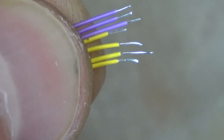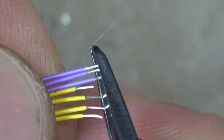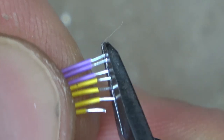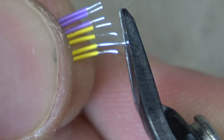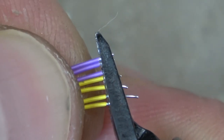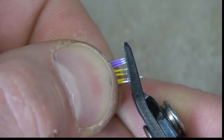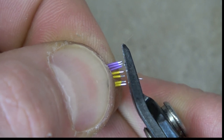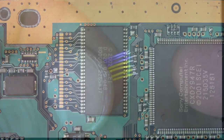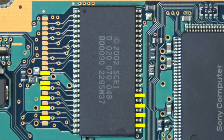After I have all my wires cut, I strip all of them. The strips are all different lengths, but I put them all in a pair of flush cutters and get all of the conductors at the same length by lining up the insulation with the flush cutters. Once I have all of those cut, it's really easy to flux and then solder.